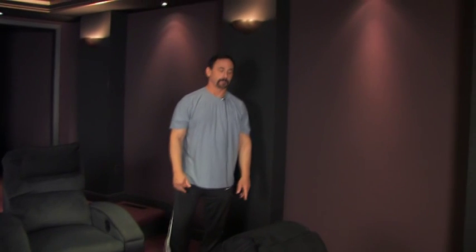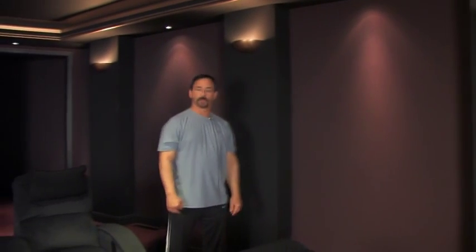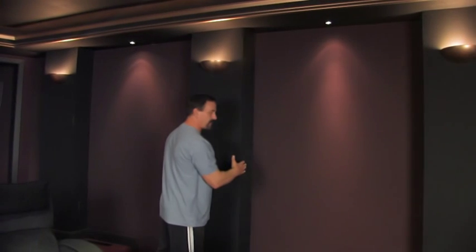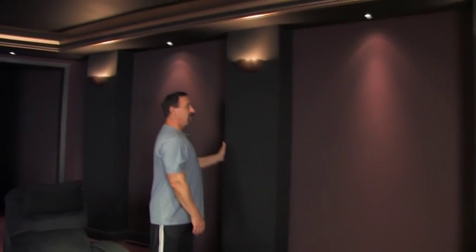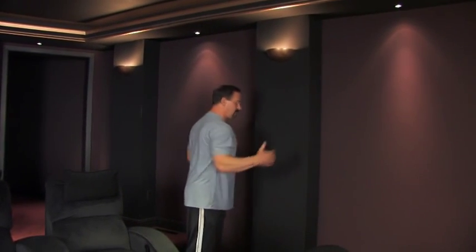The columns also hide the fact that the Guilford of Maine fabric has a certain width, so the columns hide the seams — the fabric only has a certain length, and rather than having visible seams, the columns cover them. They also cover where the staple lines are. Each column is actually a three-sided box that slides over another column that has a speaker mounted within it — the builder came up with that idea, which makes it easy to access a speaker if needed.